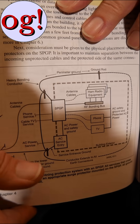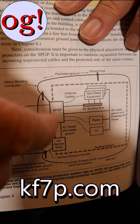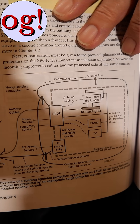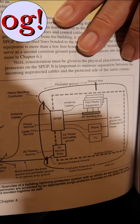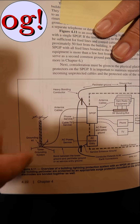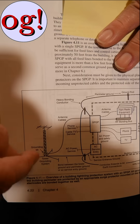The way I have mine set up, I have a cabinet made by KF7P. It's got all the lightning arrestors in it, and it forms this device right here, and it connects directly to the ground just right outside. I should point out that you will want to ground your tower, or if you want to just attach this to a ground right here, there's a little stub on the end of the lightning protector.